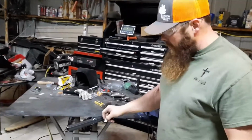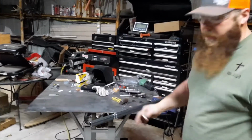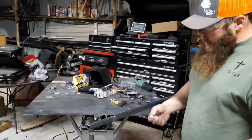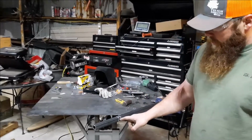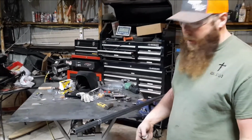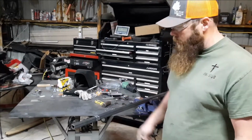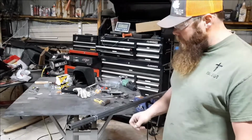So nobody explained that. I watched a lot of videos. The way I figured it was, it looked like the guy was cutting 2-inch square tubing, and he had like a square that was 1 inch wide, and he just made that second mark the width of that square. And I thought, well, if that square tubing and he's using a 1 inch wide ruler, then you make that mark half the width of your tubing, and it's worked out pretty good for me so far.